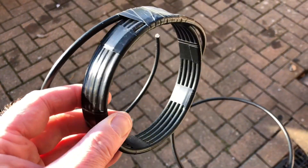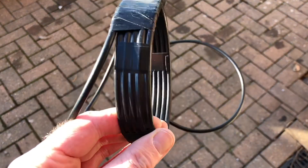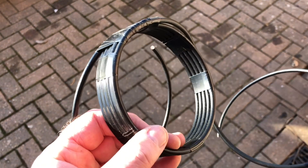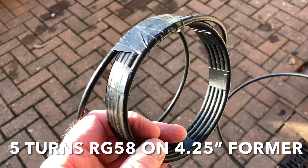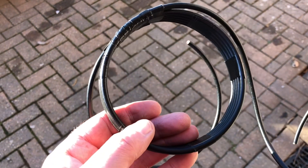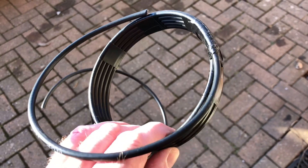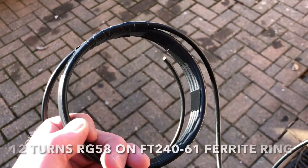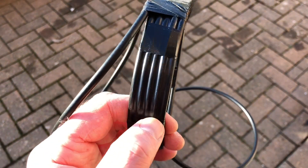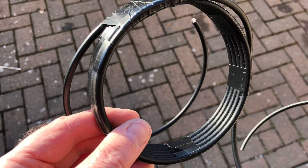To stop common mode currents coming back down the coax and upsetting the radiation pattern of the antenna — and possibly causing interference in the shack — I've made a common mode choke, which is five turns of RG58 on a four-and-a-quarter inch former; I used a roll of duct tape for mine. This just needs attaching to the centre of the antenna, and the end attaching to a PL plug so we can feed it back to the shack. Ideally a type 61 ferrite would be better, but this is a cheap build — I'll put a link in the description about chokes and ferrites.